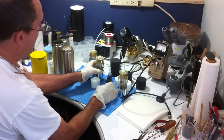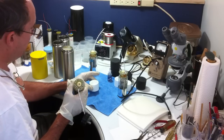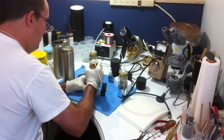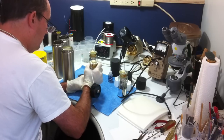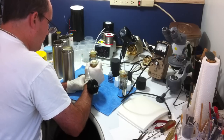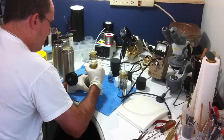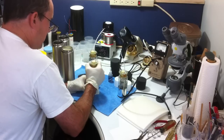I've already soldered the BNC connector on the end of the end cap to this PMT, and I've placed some very high viscosity clear silicone coupling gel onto this crystal. We're going to go ahead and couple the crystal to the PMT, using a circular motion while twisting the PMT to make sure the silicone is evenly distributed across the face of the window, eliminating any air pockets and ensuring a good clear window across the crystal surface to the surface of the PMT.